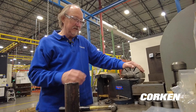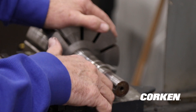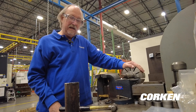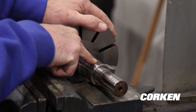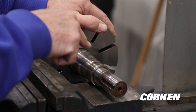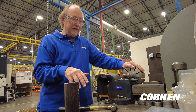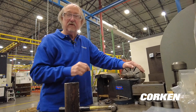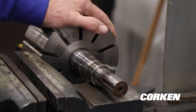But one of the easiest ways is to take the shaft, balance it — build something up behind it or have somebody hold it — and set the bearing race on the back end of a vice. Then take a ball-peen hammer and hit up and down the bearing race. The ball-peen hammer is harder than the bearing race, so it'll eventually flatten it out and form a small crack, and then you'll be able to just slide the old bearing race off.